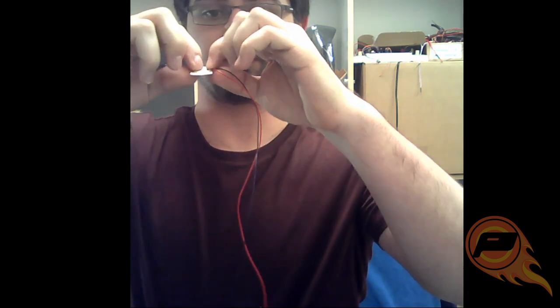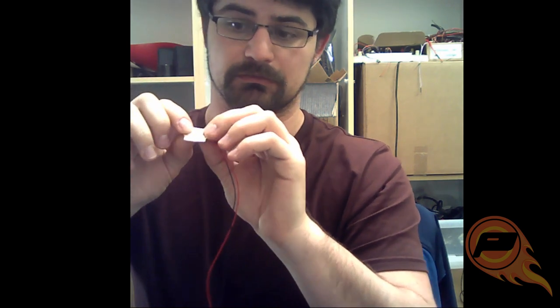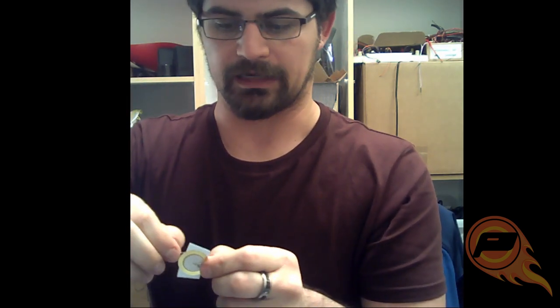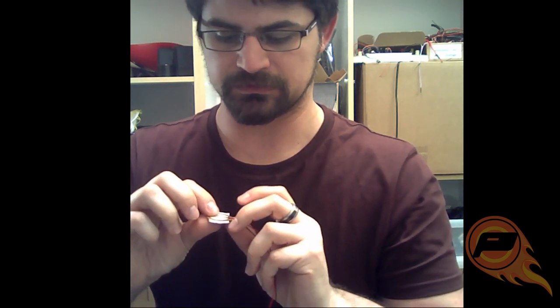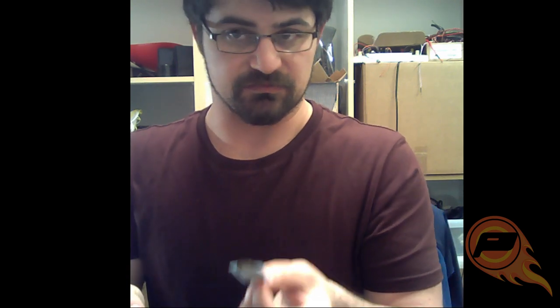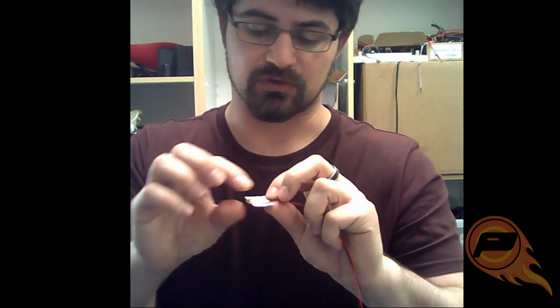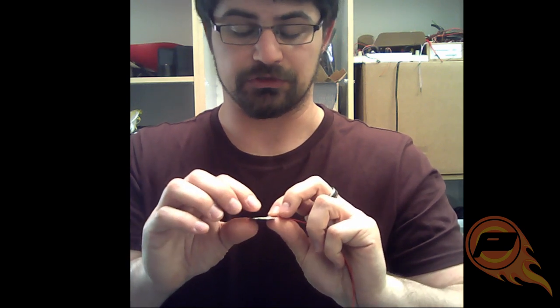So you could have it pre-bent a little bit like this, and if you bend it more, it'll give another signal. If you bend it the other way, it'll output a negative voltage instead of a positive one. So it outputs a voltage signal in relation to how it's bent and in which direction. So if you have something like a thermal situation where I'm putting it under your bed, it's going to be hot. I'm putting it next to a magnet. It's going to have some electricity in the air, like EMF in the air messing with it. But all those things will be at a sort of stable state. And the change, when you tap it, is still going to be a spike. And that's what the sensor is picking up.